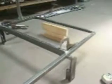Okay, I took those 2 8-inch long pieces of 2x2 angle and whacked on them a little bit and welded them onto a piece of 1-inch square tubing, and I've got it C-clamped onto the frame ready to weld it in place. And I have to weld and grind that in, and then I'm going to throw in 2 more pieces of reinforcing here in the back, and I think I'll be ready to paint after that. Zinc chromate primer. Here we come.